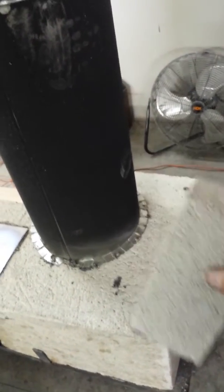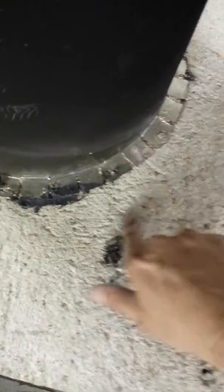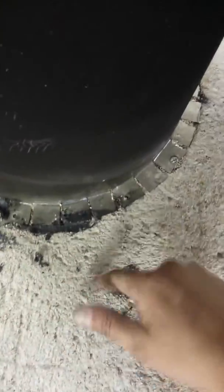I took and put the high-temperature silicone — the thousand-degree silicone — on the 8-inch pipe around the tabs and up underneath the tabs, then squeezed it down. I got just some regular brick; I know you're going to say it can only take so much temperature, but the point was just to hold the tabs down. I placed them like that, all the way around, and then this 14-inch pipe fit nice and snug down at the bottom where the bricks are. I packed the dry vermiculite back in there all the way down. Some of that high-temperature silicone is pooching out here, which is fine — it sticks really well to the concrete so hopefully it'll hold it in place.